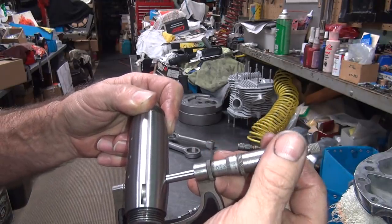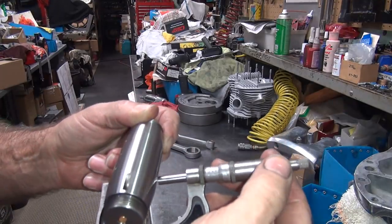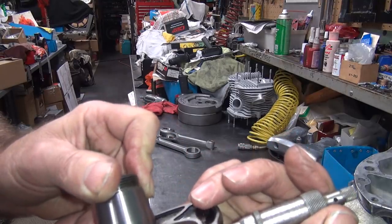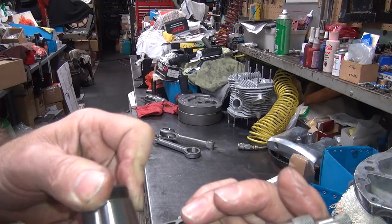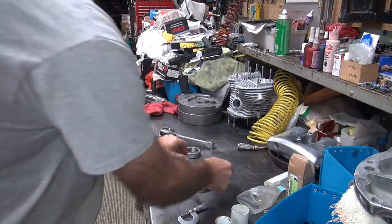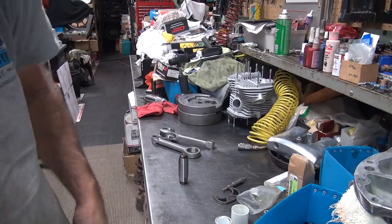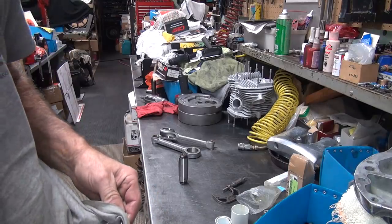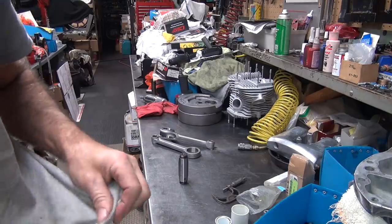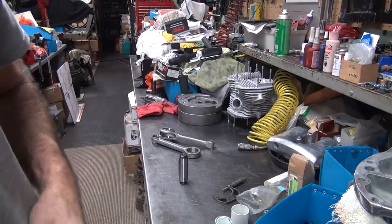9. Okay, we're coming up consistently. 9 on the mic. So that's 1.1 thou undersize. 11/10. That one there is 9. Okay, so it's 9. Okay, so that one's pretty far under. Usually it's like 6/10 under to 8/10 under. That one's 11/10, so a little extra. Okay, now we get out our other mic. Make sure this one's clean. This is a carbide tip mic on this one, so it's a little more accurate than my other one, even though they measure the same.